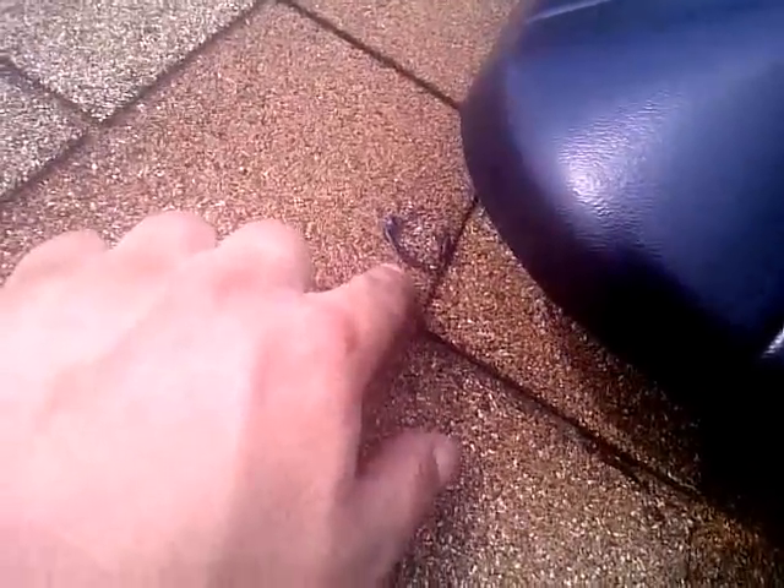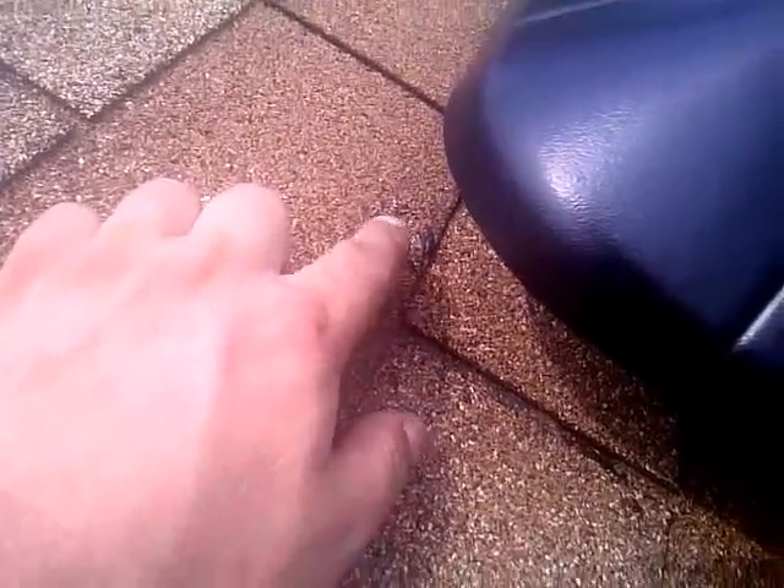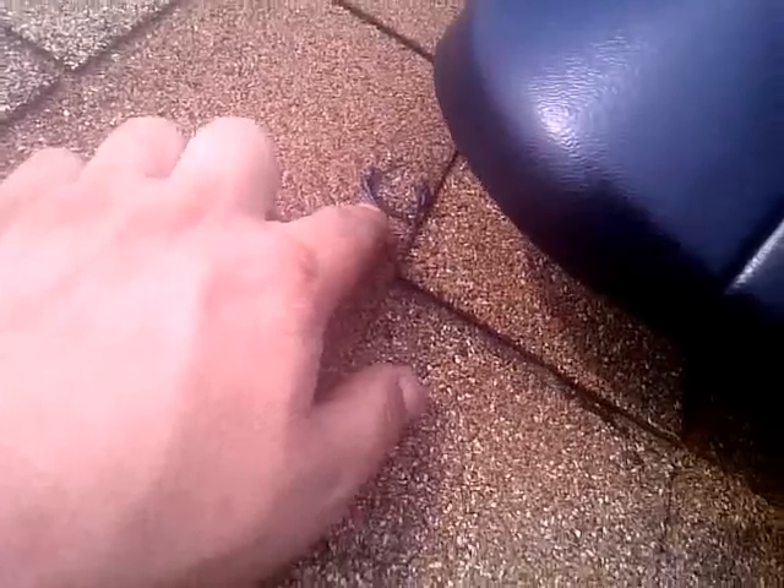If you look at the fan and the roof here, you can see how the shingles overlap the fan. All the water and rain is going to fall right over the shingle and right down on the fan and off the roof, so you're not going to get any leaks — this is how we do all of them. These are our mounting screw holes. We use stainless steel screws, then we seal it, and we take some scrap shingle and put that on top with a nice dab of sealant on top of the screw.